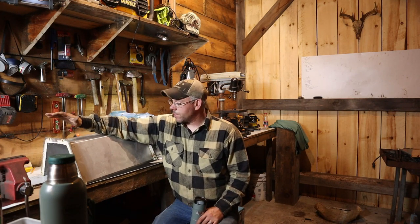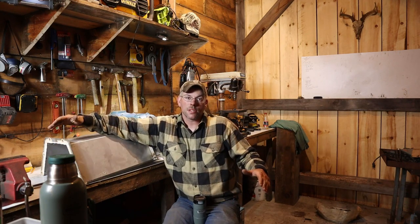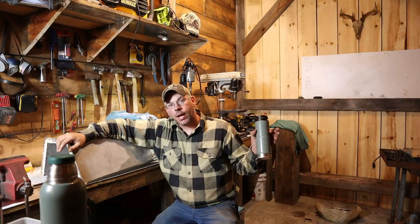So basically what we have left to do on this, we've got to cut the hole so we can get that return air out of there so the exhaust air can get into the fan itself. We got to blank off this end, and we're going to extend them out, so this hood's going to be a lot wider by the time we're said and done. So I'm going to get it probably a few feet off of the top of the forge. I need it high enough so I can work, but I need it low enough so I don't have a bunch of flue gases escaping and filling up the space, especially once we get the bats on these seams.